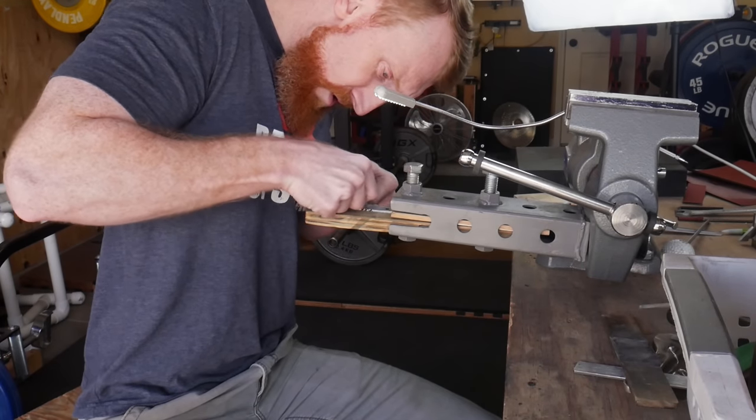For the handle scales we'll be using natural canvas micarta that has little chunks of carbon fiber in it. I found that this stuff is pretty much indestructible and it is impermeable to any type of liquid as well, so if you'll be using this as a skinning knife or whatnot it is the best option. To drill the holes, drill presses aren't really necessary — I decided to use a cordless drill. For handle pins we're going to be using 316 stainless bolts. The bolts, since they have ridges in them, allow the epoxy somewhere to go and I found that the bolts actually work way better than straight pins and a little bit better than Corby fasteners as well. Before starting your glue up, make sure to touch all the pieces with your hands — you want as much grease from your hands on the pieces as possible, as this helps with your epoxy bond.